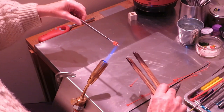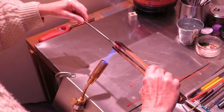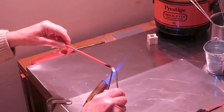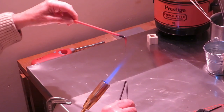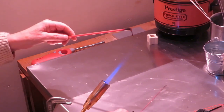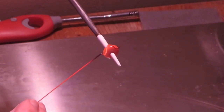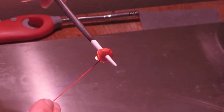Here are some examples of shaping and decorating beads. This shows working with wooden tongs that have been dipped in water to stop them burning. I am making a cylinder bead. And here I am using tweezers to pull a thread of glass, a stringer, that will be used to decorate beads. Here is the stringer being applied to a bead to make a wave pattern. The added glass sinks into the surface with more heating.